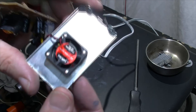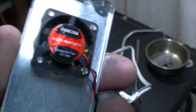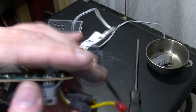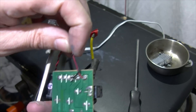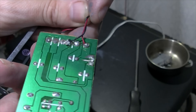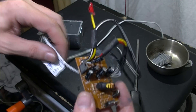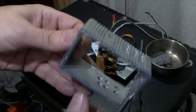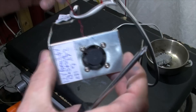I fitted this 25mm fan inside - it's soldered up onto the 12 volt output, on the 0.5 amp side. As I say there's a 0.5 amp and a 30 amp output. Let me show you the case - you don't get the holes in it, I drilled those in to give it some air ventilation. It doesn't come with the fan either, which I fitted.